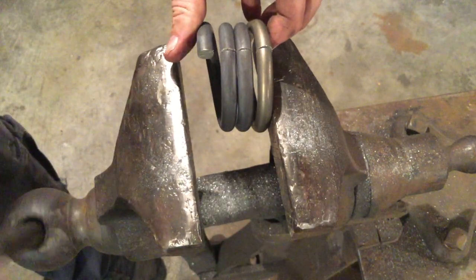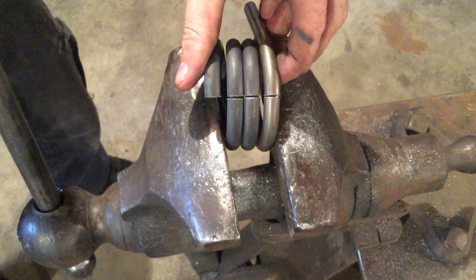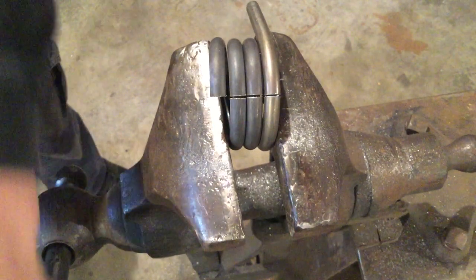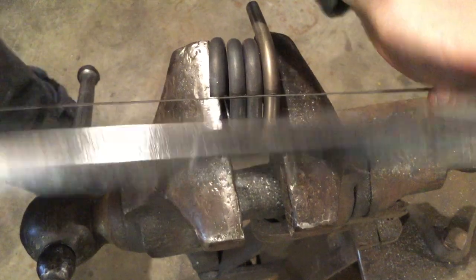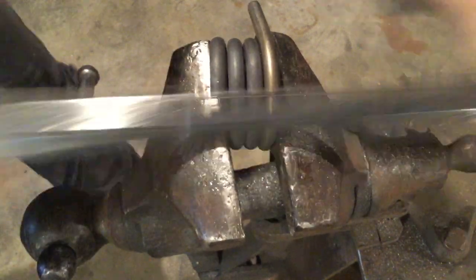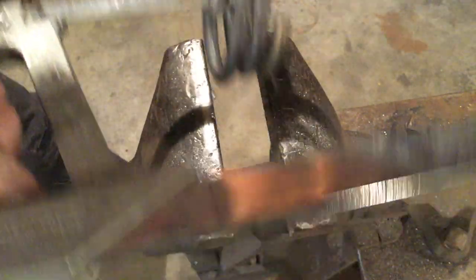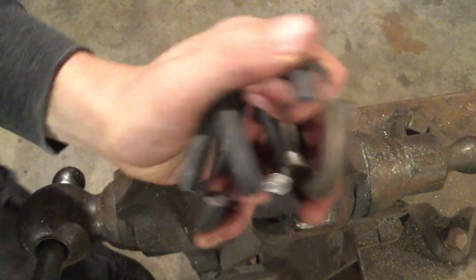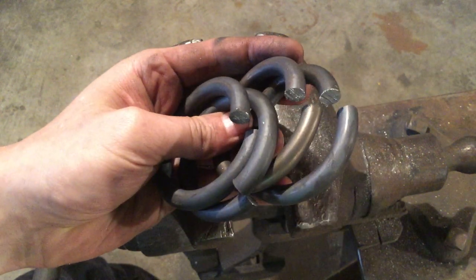What I'm going to do is switch positions so that I'm clamping the outside of the ring, to make sure that this bar clears the vise but I can finish my cut. You want to have your cut clamped firmly so you can get in there with your blade, reseat it, and then you should have your rings captured on your blade — like so. That'll give you a nice clean set of O-rings, the same way you would with the portaband.